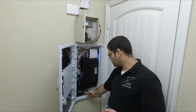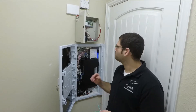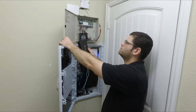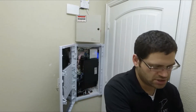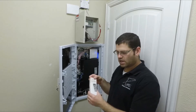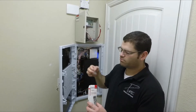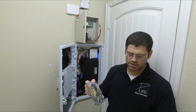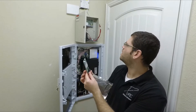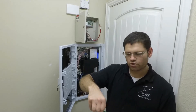We're actually going to go through our Watt Box down here, which has a grounding post that goes into the earth ground, so that we can ensure we're all safe from surges and things like that. So we are going to go ahead and get everything installed. With the Elan piece here, we're going to use some heavy-duty Velcro and attach it right here so we can use the adapter piece and plug it right into the IT100. Inside the IT100 box you've got the clips so that we can mount the board to the panel. Inside the static bag we have the board itself — these four terminals connect it to the DSC mainboard, and we have our DB9 connector for RS-232.